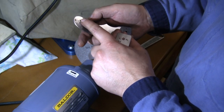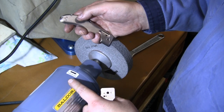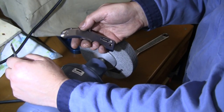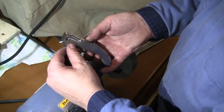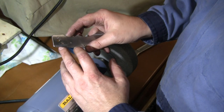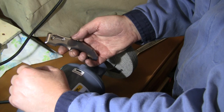I have not gotten this other one out. I tried drilling it with a carbide drill bit, pushed it a little bit through from that backside, but I was not able to get that one out. So that pocket clip on this one will just be held on by 2 screws, so obviously not one I can sell, but still going to be able to fit this together. So truly struggling with tapping the holes in there, and even tapping by hand on this one after I had tapped those 3 holes over there, I was just feeling all right, but man, snapped another tap off by hand in this one. So I think I just have clearly the wrong taps.